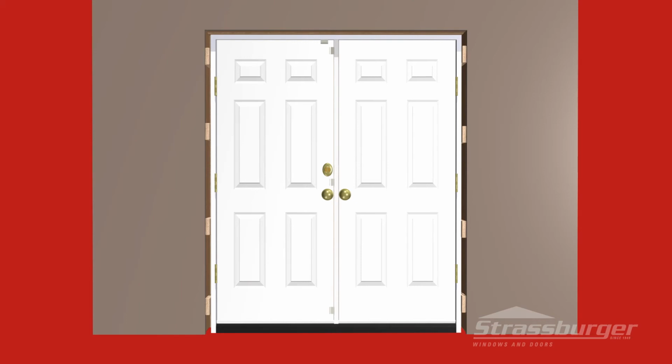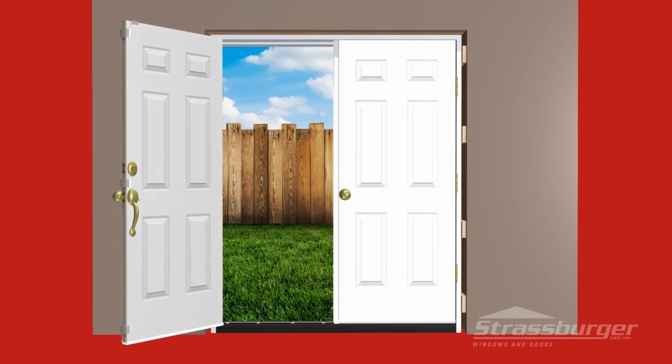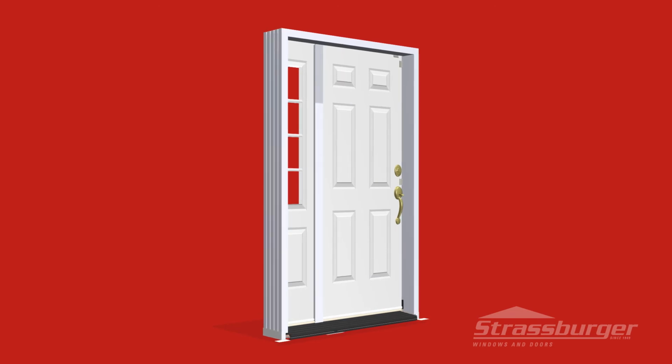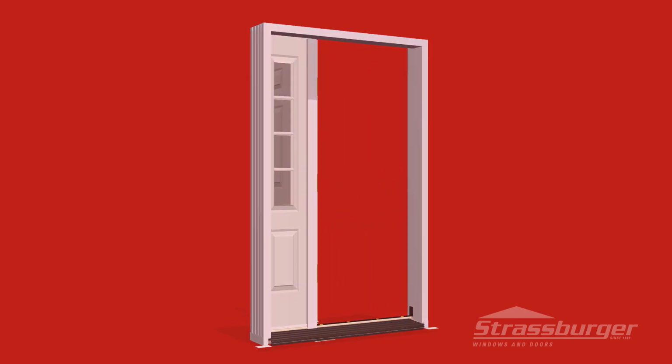Prior to installing your trim around the door, unlock and operate to make sure you have not hampered the operation of the door. You are now ready to install your trim. If your door has side lights attached, please view video instruction titled Door with Side Lights.